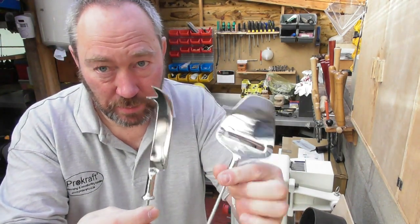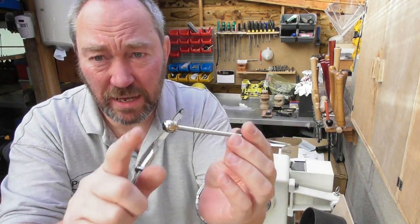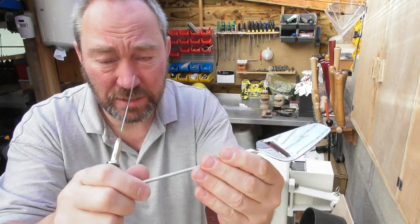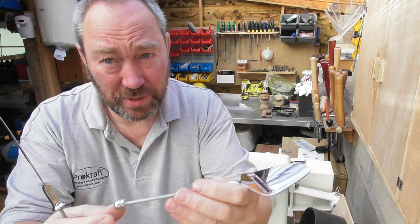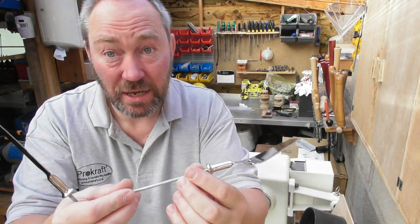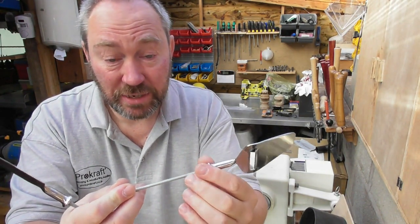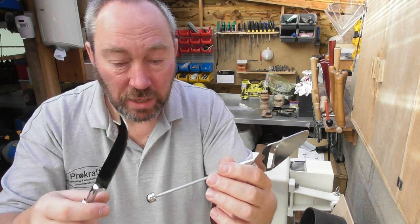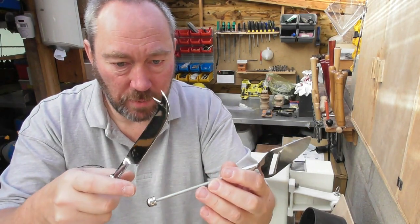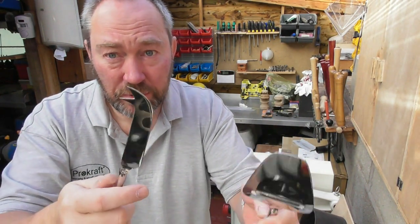This is one kit. They come in a pair, and you will see they have a central shaft down there and a little knob on the end. They all screw together. They're pretty simple, to be honest. It's a turn between centers kit. If you have a 4.5mm drill hole through your piece, then that will just push through. If you drill a 4mm hole, then you will have to screw that through your piece, and exactly the same with that. They are both stainless steel.